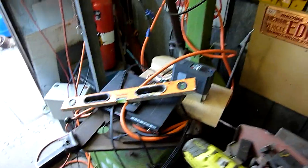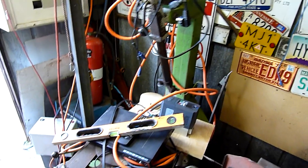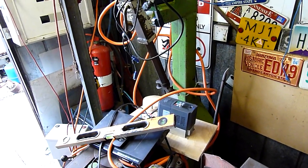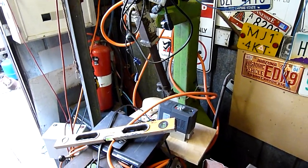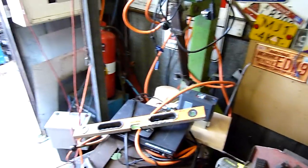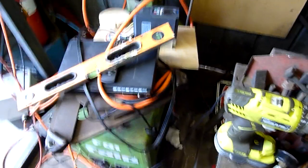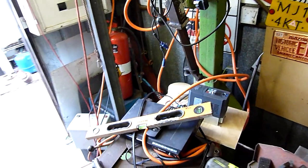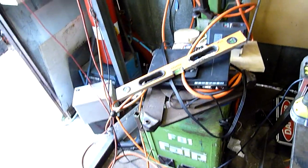The tire machine — I was having trouble setting up the VFD. I think I understand how these ones work now. It's not basic analog relay logic anymore; it's like a CAN bus or something like that. I need to digitally assign commands to the input channels — it's got input channels and you can assign what command you want and what parameters for that command. I just need to spend a fair bit of time programming it and I should be able to work it using the foot pedal, forward and reverse. It'll just be jog but it'll have its own torque and frequency curve, and I'll bolt it on the back as suggested by a friend so if the VFD blows up and catches fire it won't damage anything inside.